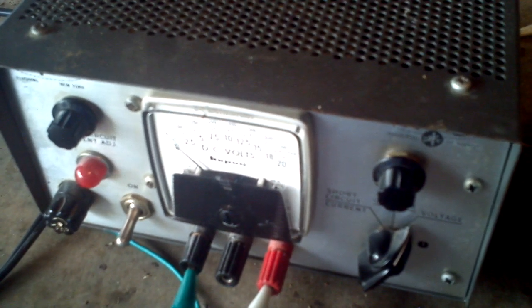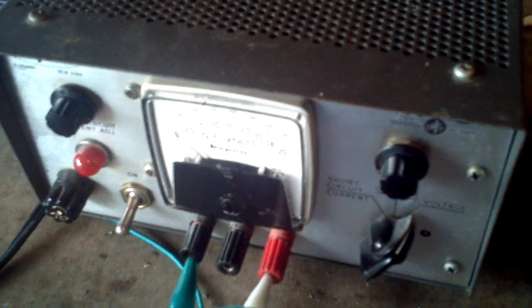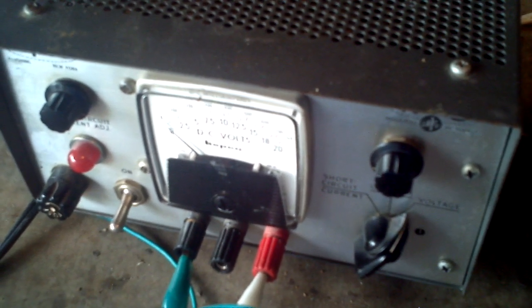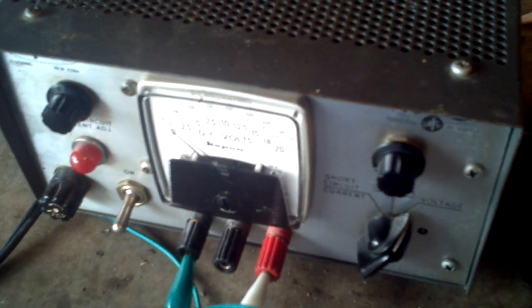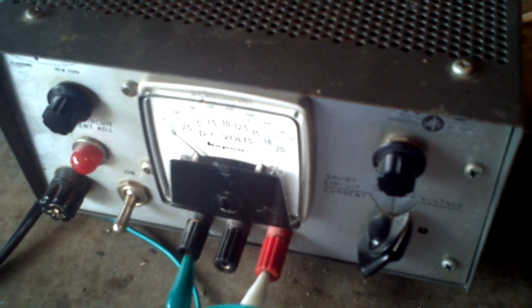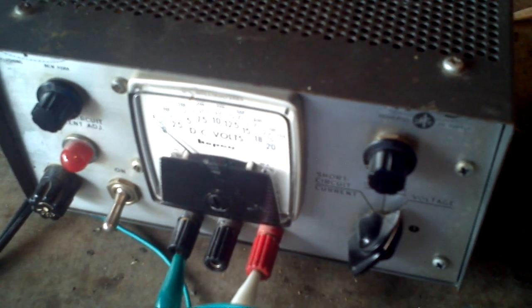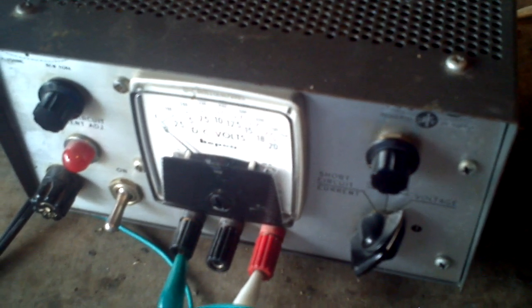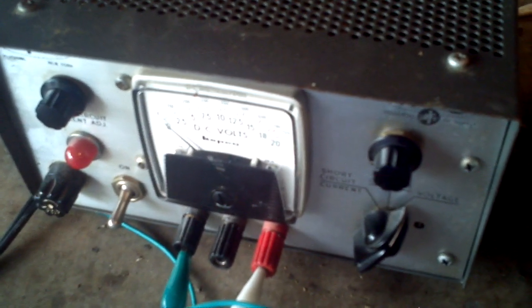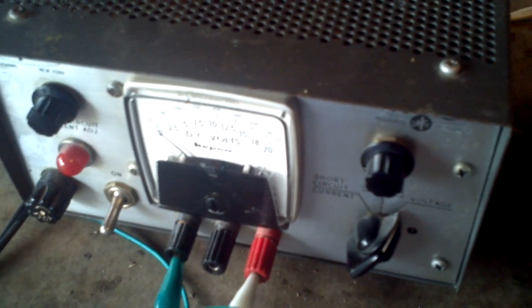I have the bullet maybe two inches away from the electrode in the bottom of the bucket, so very, very slowly. I've read online that some people are using 6 volts, 7.5, some even 12, but it just hasn't worked for me. I've adjusted this little power supply down to about a volt, volt and a half, and it's running at maybe half an amp of current.